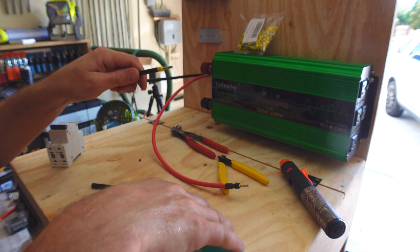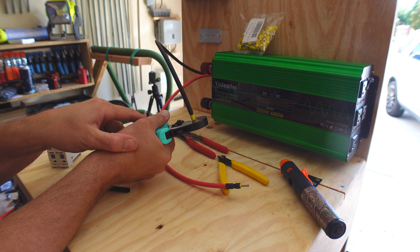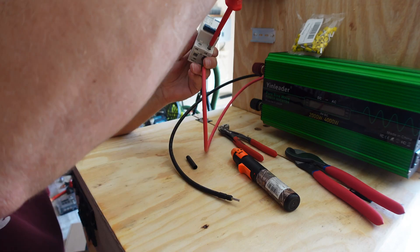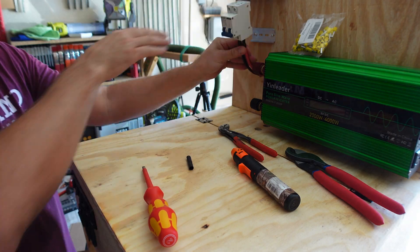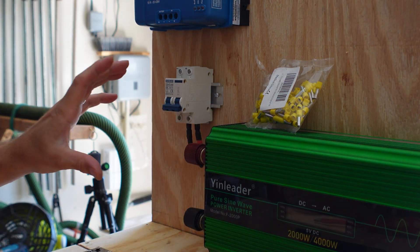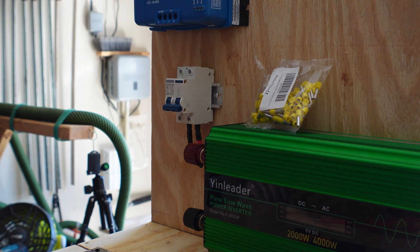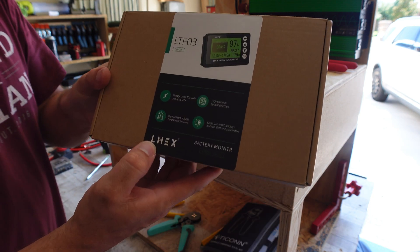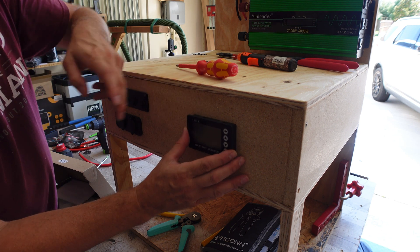For the negative side, same thing — I've got the ferrule installed already, just put it inside the crimper tool and squeeze down. These ferrules should provide a much better connection to everything. I can get a couple of small pieces of lead wire to connect negative to negative and positive to positive on the PV side, and that'll complete that part. I also went ahead and got a different kind of battery monitor — picked it up from LNEX. I need to cut a hole and have it sitting in the vicinity of this area, so I'll mark and cut and get that sorted out.